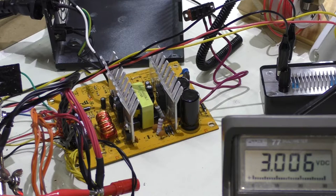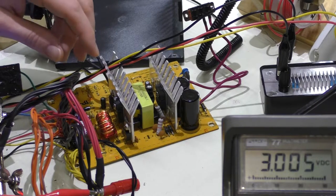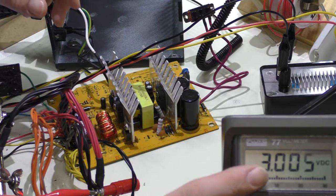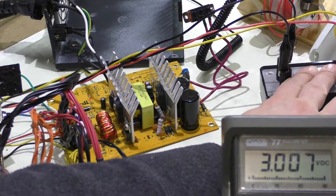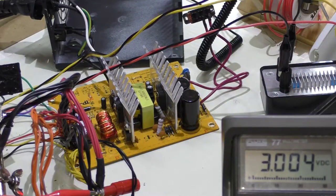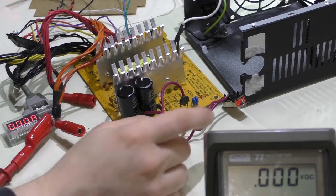I'm a bit perplexed now because I actually found two capacitors on the main board that had bad solder joints — I could just wiggle the cap and it was completely loose, meaning no good connection. They all happen to be relative to the outputs, so I thought maybe that's why we're not getting the correct output voltages. I repaired the two botched solder joints, but we're still not at the proper voltages. I also have a power resistor hooked up to both the 5 volt and 12 volt lines to load them, but that's not bringing the voltage up either, so I have to delve in deeper.